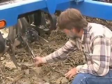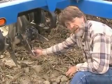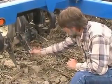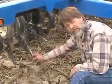And it's because this soil, which if it were parted in the opposite direction would remain undisturbed, as is the case on some competing technologies that look like this tine, removes any of the compression forces that have been placed in the soil during the entry phase.